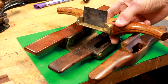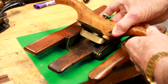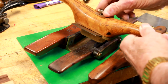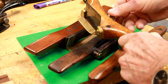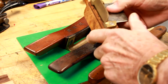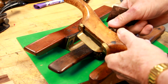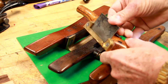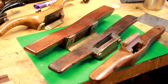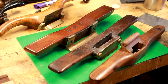One of the most unique I've seen is this ram horn style scraper. The brass wear plate — the blade guide — is fixed; you don't have to loosen screws to raise and lower the blade. He put a through-screw in the back with a bar that presses on the blade to keep it locked. When you turn the screw it pushes the back of the blade into the brass fixture up front to lock it. I literally have close to a hundred different style craftsman-made scrapers — chair scrapers, ram horn, etc. — in my collection.